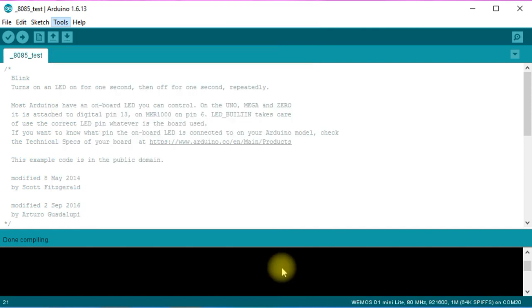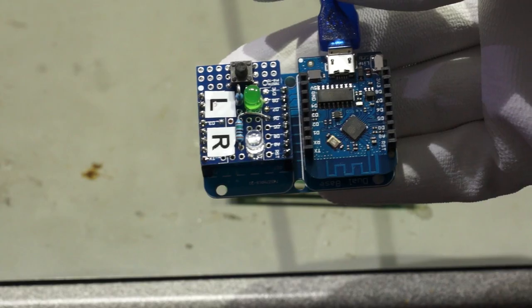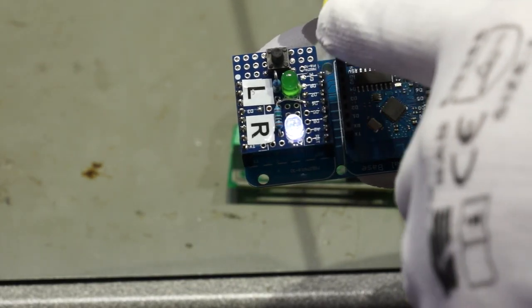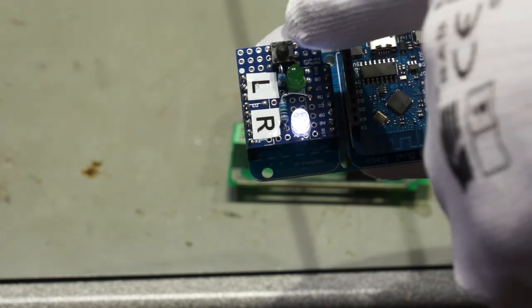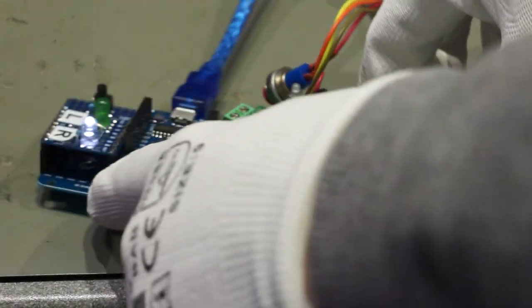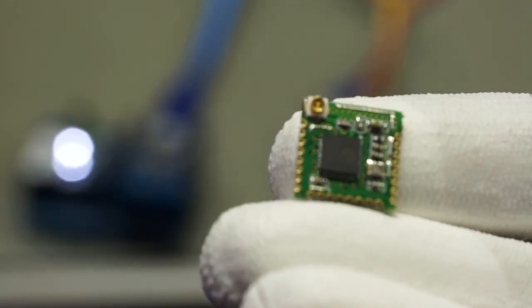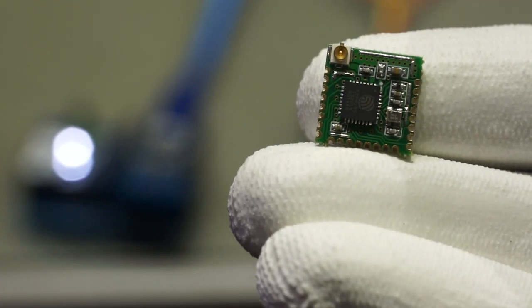This has to be done only once, and you find the links in the description. For guys like me who develop for the Sonoff devices, there is another small advantage. Because the Sonoffs also have only 1 MB flash, we can use this board to develop our sketches. I even built a small Sonoff simulator with the typical green LED, a white LED instead of the relay, and a button. With this, I can exactly simulate my Sonoff switch without the hassle of always taking a switch apart. And of course, if you want to develop a sketch for this tiny ESP8285 board, this is the perfect platform.